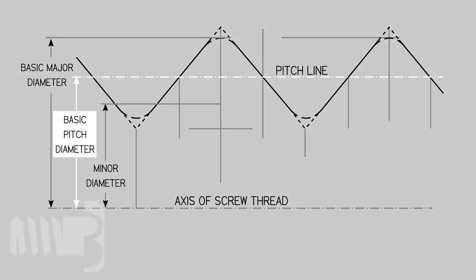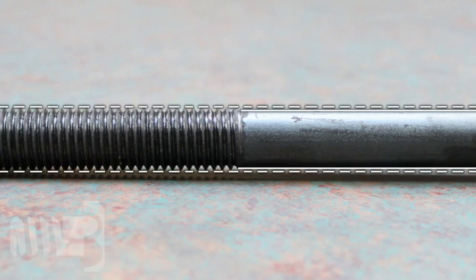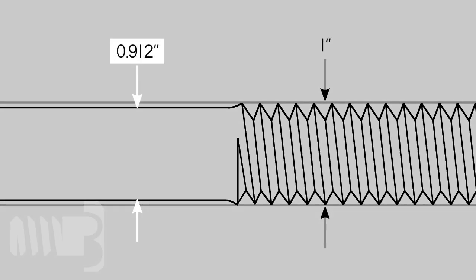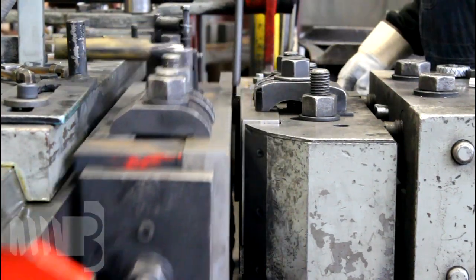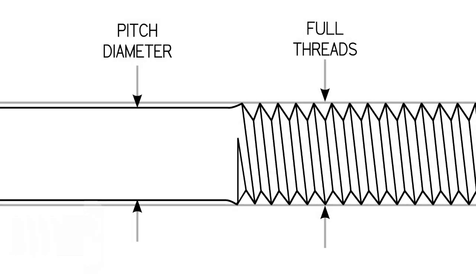The pitch diameter material is approximately the midpoint between the major diameter and minor diameter of the threads. For example, if a 1 inch diameter bolt is being manufactured with rolled threads, it will be made from a 0.912 inch diameter round bar. Once the steel has been rolled in the threading dies, the fastener will result in a full 1 inch diameter threaded portion but with a reduced body diameter.